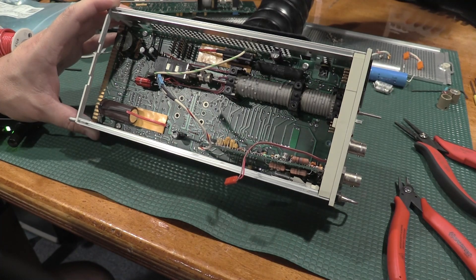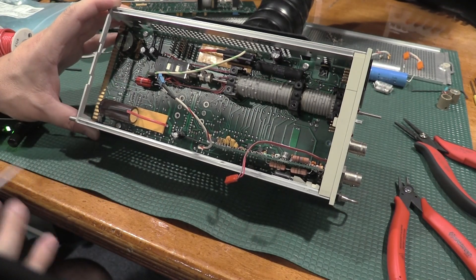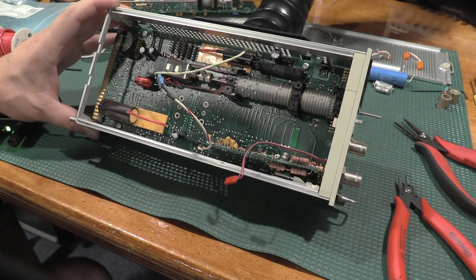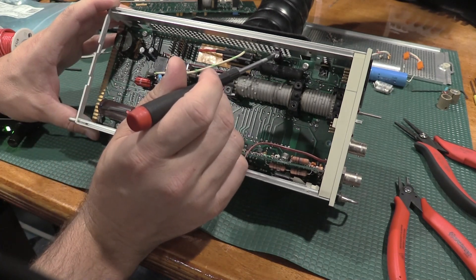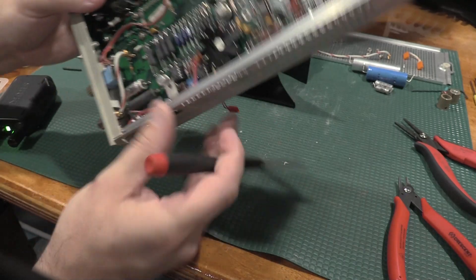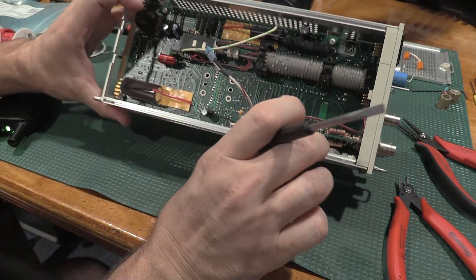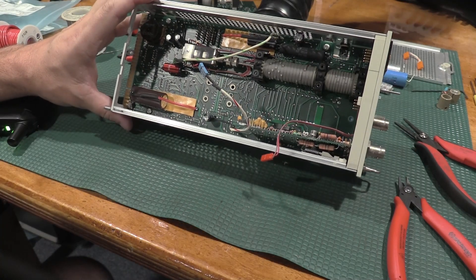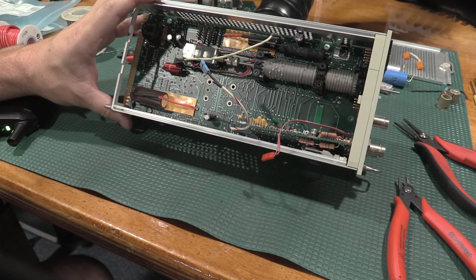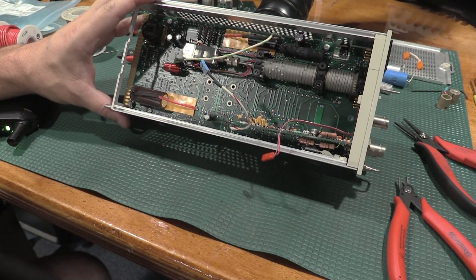All the holes are blind, so I had to do a whole lot of test fitting. I had to do all the work on this side of the board — I couldn't even get to the other side. This capacitor right here is buried by some diodes, and same thing up here — this lead is dead center on the bottom of a resistor on the other side. Doing this service, I had to do everything from this side of the board, and it was a royal pain in the butt. There is not a lot of room. I was checking for shorts, making sure I didn't get solder bridges. This is not an easy upgrade — it'll be worth doing when it's done, but of all the tech work I've done so far on and off the channel, this has been the biggest pain in terms of getting access. It is very tightly packed in here.